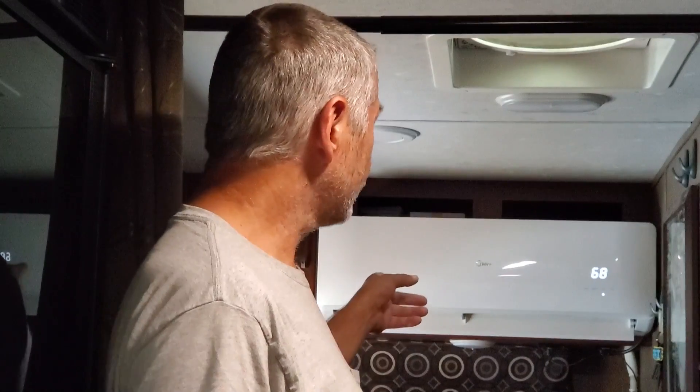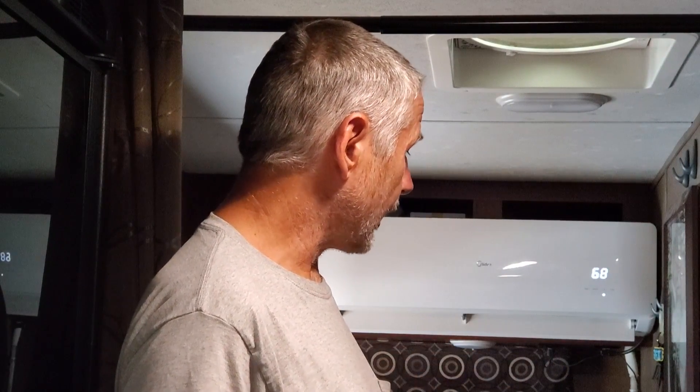We're on the inside now. I wanted to show you a couple of things about how to mount this. The inside unit comes with a plate that you can just screw to the wall. What we did — because we didn't want to put any holes in our cabinet — was use two pieces of wood sandwiched around the cabinet, and then screw the mounting plate to those pieces of wood. Then all you have to do is hang the inside unit on the mounting plate, and that's the entire installation of the inside. After that, you simply connect the copper lines. It also has a drain line — you can see the white drain line going down — so when you're in dehumidifier mode, it drains water out of the RV.